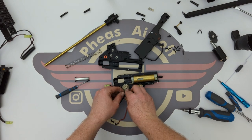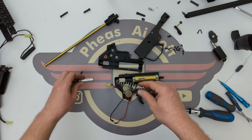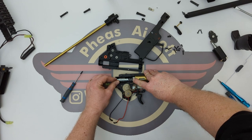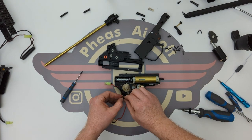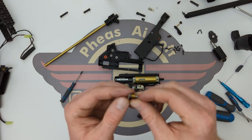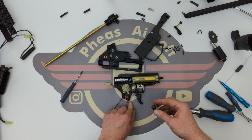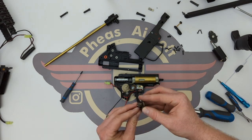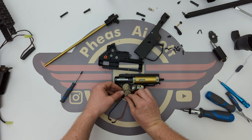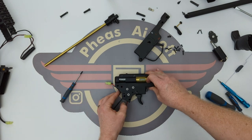Right, that's better. So what I had to make sure of — and this is why it kept jumping out — this little spring goes all the way down on this peg, making sure the sealing head lug hole on the bottom is in position and the piston is on its runners. Next I'm going to make sure the trigger is set properly, pull the anti-reversal latch down, wind the gear back against it to create some pressure, then bring my spring in. The anti-reversal latch sprung — it's okay. It is quite a short, tiny little spring. I've pulled it back, just compressing it downwards with my thumb; a shim dropped off at the bottom and I need to make sure that's not free-roaming the gearbox.